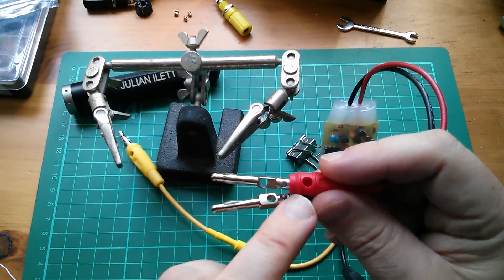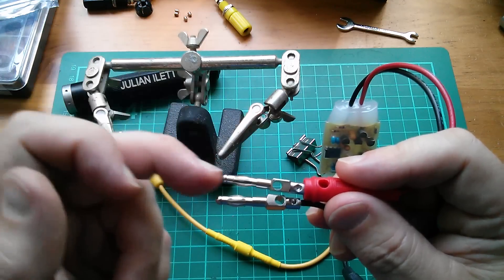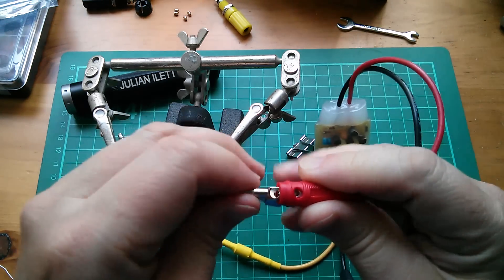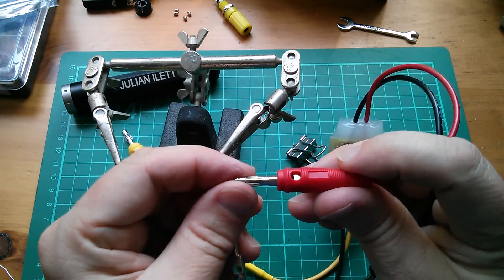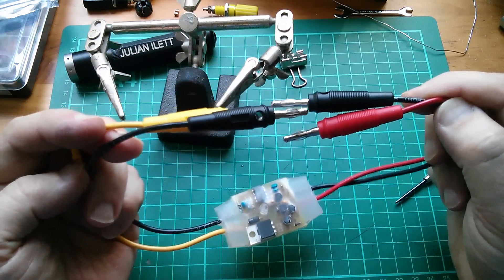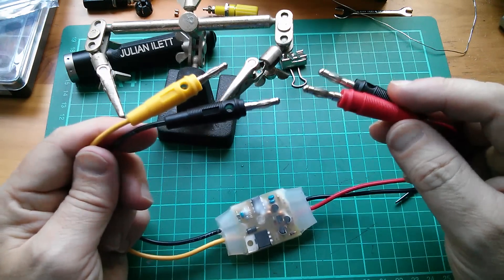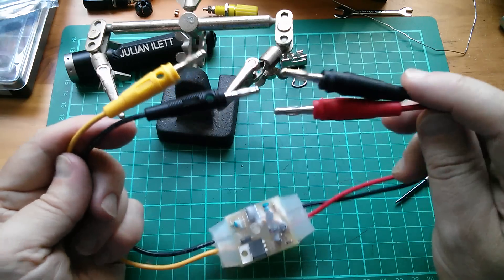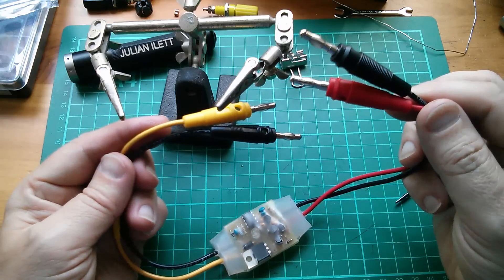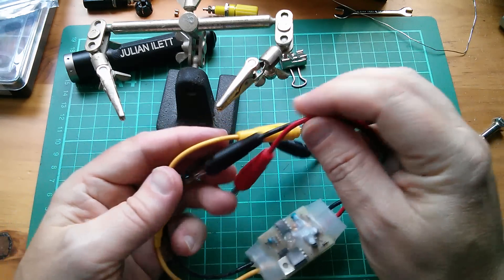This one — the hole doesn't quite align with the hole in the cover. I can see why: they've drilled the hole in the banana plug terminal too far towards the tip, whereas it should be further back. Misaligned hole — I'm not too bothered, it just doesn't quite align. So, solar charge controller with banana plugs on it — that should plug straight into my system outside. Now you might think that banana plugs are not a sensible connection system for outdoor use, and they're not. Every year I have to replace them because they go all rusty. But a lot of what I do is demonstrations and I need to be able to hook things up and unhook them quickly, so banana plugs work for me in that respect — they're very visual and not complicated. That's why I use them, even though I end up replacing them every year.